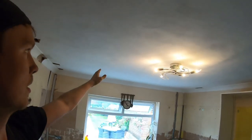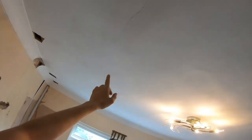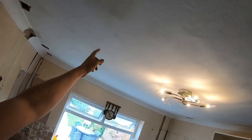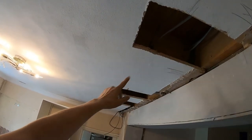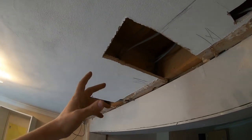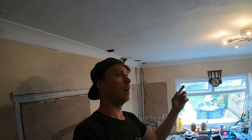With here, because obviously I'm going to do three here, three there, so you would just do the plug here, you would rod across to each one. Most of the time, like I do, I do a 4-inch hole if it's being overboarded, get my hammer up there, manage to tack a cable there on each down light, bring it back, and then you drill all the joists through where you've made your 4-inch hole on the joists. It's a similar thing here, but obviously there's big holes that the builders are gonna have to fill in to do it across. So I'm not gonna film myself cutting all the holes out because I've done that in loads of other videos, and time's running on a bit, to be fair here.